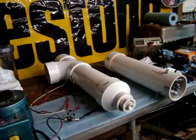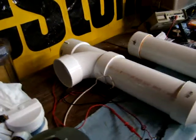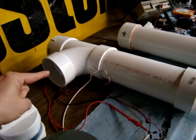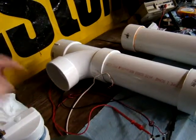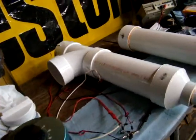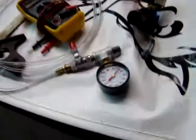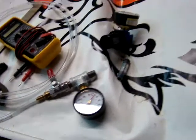What this amounts to is a lot of PVC. You've got a T-fitting, there's a clean-out down here on the very end which will have a plug in it, and that's where the carbon rod is going to live. There will be another tube attached here that has the stainless steel wire in it, which is electric fence wire. It's being used as the positive plate, so to speak, and up here on this end is where I've got it reduced down to where I can hook a quarter-inch pipe, which will have my pressure gauge and a ball valve.